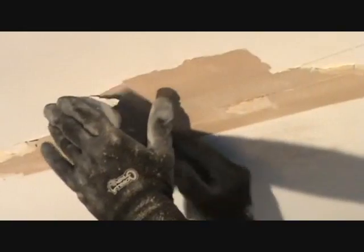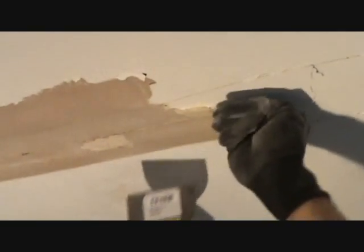So here's the sheetrock nails. And see, that's the mud that went over the tape, and that's all loose. I wanted to take off anything that's loose, and I'm just using a cheapo 3-inch putty knife I got at the store. Not an expensive one, $3 I think it was. First I'm just gonna get anything that's loose. If I'm gonna put mud up here and self-adhesive tape, I gotta make sure that's gonna stick, don't I? And I also want to make sure I don't see any mold residue underneath here, because this is kind of discolored, and I'm hoping there's no mold under here.